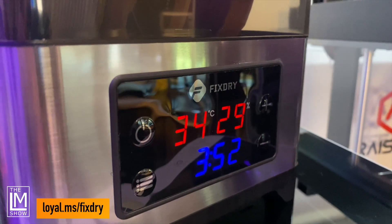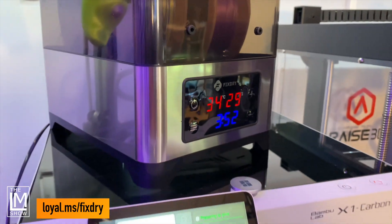Back to the elephant in the room — why is my filament not ruined? I live on a mountain with relatively low humidity throughout the year, ranging from the teens to the low 30s depending on the season. Filament does absorb moisture, but with PLAs and PETGs it's not enough up here to be concerned with. ASAs, nylons, polycarbonates — those do absorb moisture and need to be dried. We use a Filadryer filament dryer for those; Filadryer was kind enough to send us one, and I'll have an affiliate link in the description.